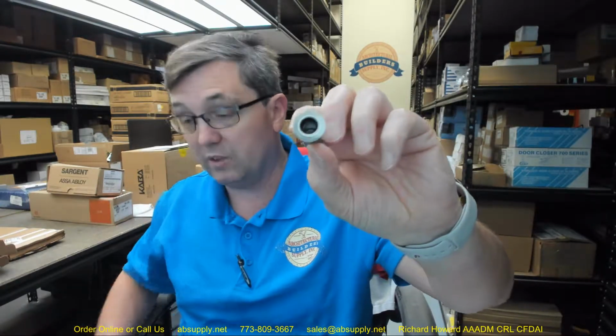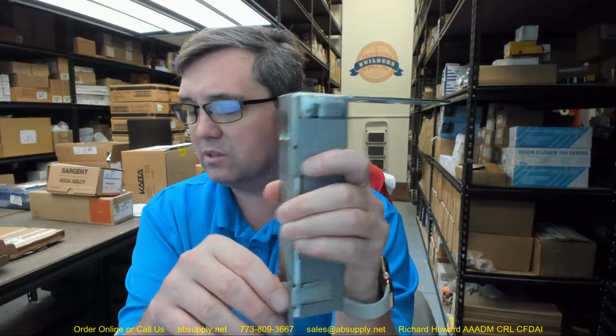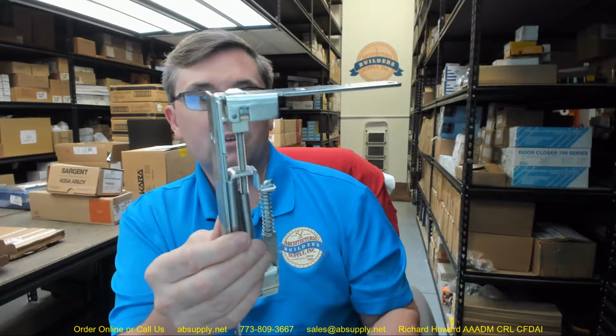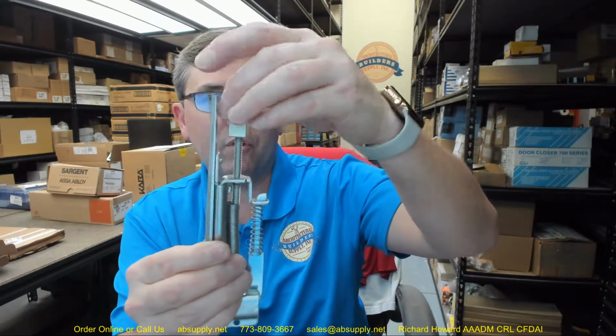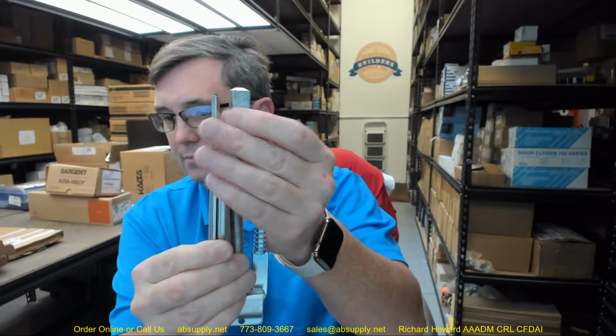Continuing through the extended description: a smaller profile, making it less noticeable. That could only mean the bottom firebolt in that regard. It is petite, and we're going to go over the dimensional properties. Adjustable bolt head rods. Bolts can be adjusted 1/2 inch for unusual clearance, low closing force, and an override feature. So you can literally thread that to tailor your projection. Get it exactly where you want so that you have proper and full complete engagement of the bolt head into the strike, up to 1/2 inch.